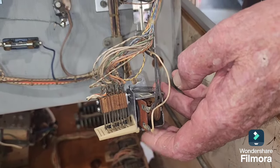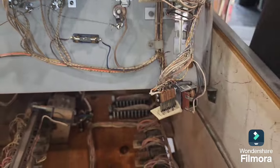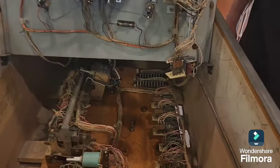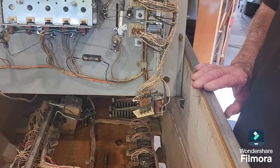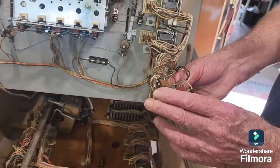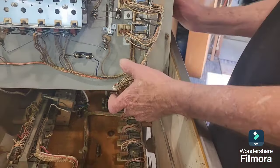We'll put that back in the game and troubleshoot the ball kick-out. It's a good method to use, and it works especially well on hold relays and alternating relays when they make a hell of a noise. That relay has five switch stacks — all make-break — and because they can be held on for so long, it just annoys you when you play.